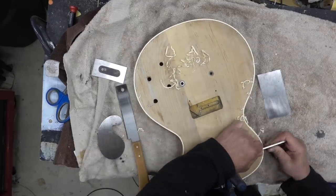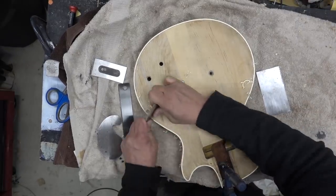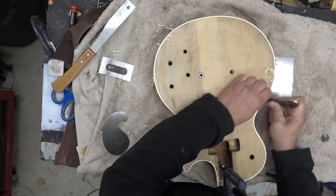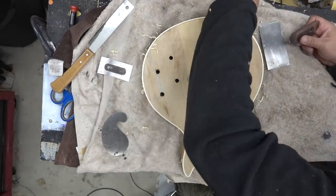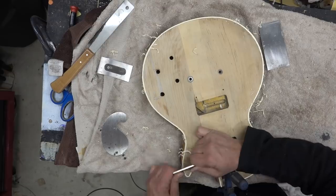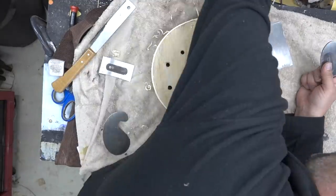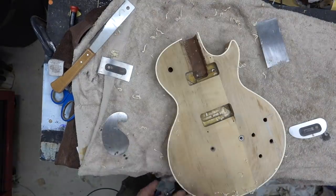We reclamp this to the bench and begin scraping. You can't really sand with a heavy grit — you've got to scrape it. My favorite scrapers are the thicker StewMac scrapers. The thinner ones don't take off as much, but these thick ones from StewMac actually work really well. And no, I have not been compensated by them at all — I've just purchased way too many tools. The thin ones don't take off as much material and you can't go as hard at it, but these thicker ones work really well, specifically for the Les Pauls — when you're using that thick binding you need the thicker scraper.